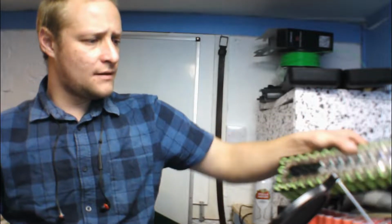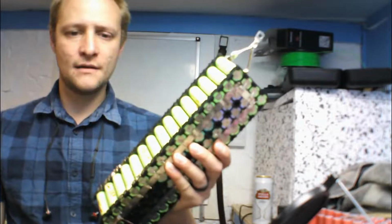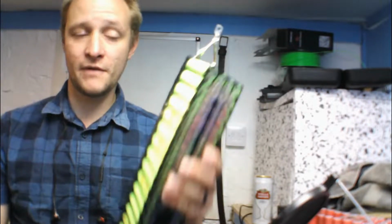So you're running three. Hang on. You're running 3 GridTie inverters with 20 kilowatt hours of 18650s. Yeah, that's quite some feat. I mean, I figured out I'm still going to keep it at 24 volts because I don't think I can handle running 48 volts because my panels aren't set up for that. So run 24 volts, 9. Let's have a think. 7, 14, 21 of these works out just over 9.3 kilowatts.